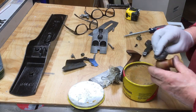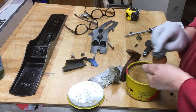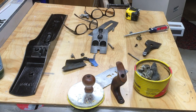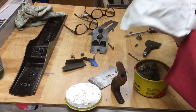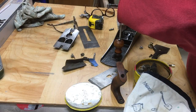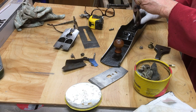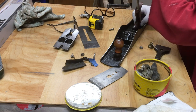Here I'm applying wax to the knob and the tote. I tend to apply wax with steel wool — the steel wool helps to take off any little fuzz left by the raising of the grain that the stain put on the wood, and it helps smooth that surface off. I usually let that sit a while and then buff it with a towel or rag. You can see it gives a subtle shine — not super glossy, but subtle — and it feels great in your hand. It looks really great up against the shining brass and the almost chrome-like screw on the tote.